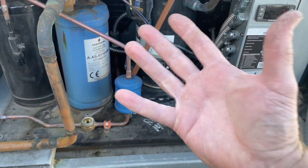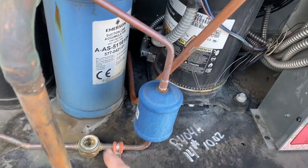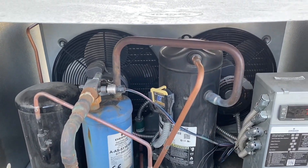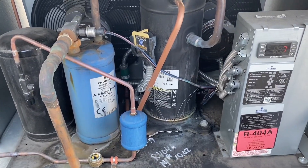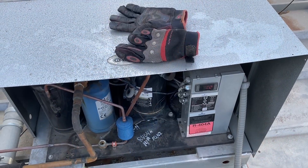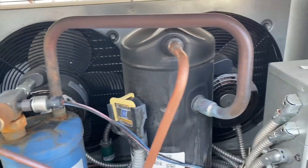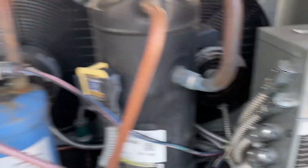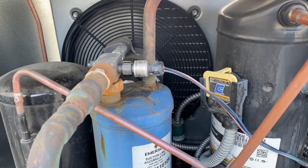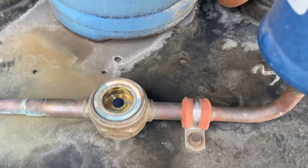Supposed to be a five-week lead time. I think I'm four weeks in, so it should be soon — coming real soon. I thought I'd bring you guys along for my little checkup here. Alright, it just cycled on. Let's get the head pressure up. Put the kick on the condenser fan. We'll see how we're looking here. Checking some heat. There's that pressure — pretty good. Sight glass is still clear.